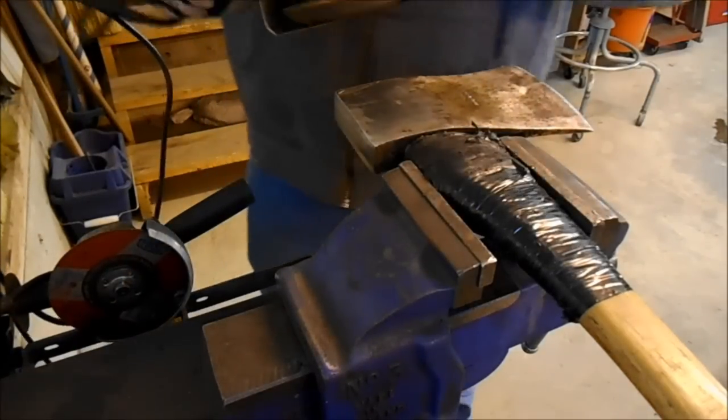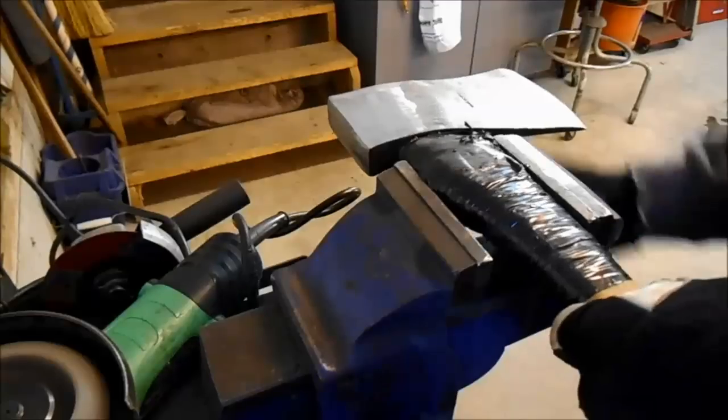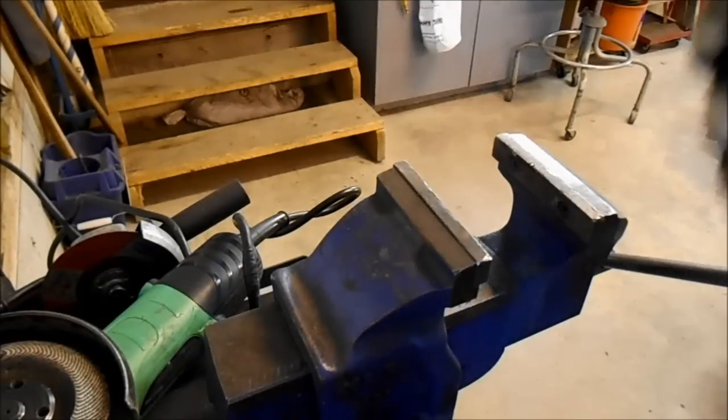More and we'll have a look. Okay, tubes, as always you end up taking off more than you want, but now there's no more mushrooming left on that axe. A little bit on the left side, just like my other one. And now I'm going to finish polishing the axe with a less aggressive tool. I'm going to make sure I keep the Made in Sweden SBA on this side and the 3.5 pound on that side. We won't grind those away. And there isn't actually a lot left on this.